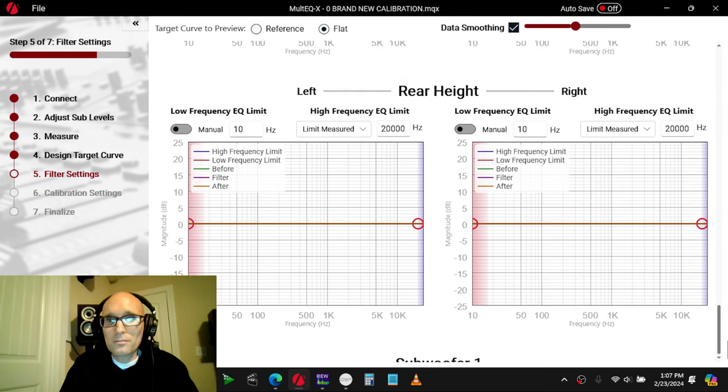So let's choose another one, around 90. That might be a performance increase, but you did invert the polarity. That might be the way to go. Huh. 18 delay, though? I don't think I can even do that on the receiver. I guess I could put it into the mini DSP as well, and delay by that much. So impulse aligning wants me to actually delay by that much and invert the polarity. Okay, let's try another one. Ooh, that's good.